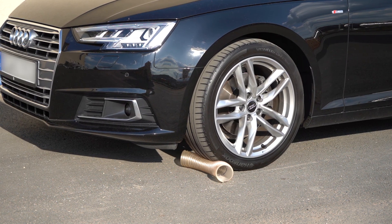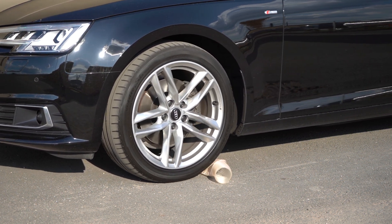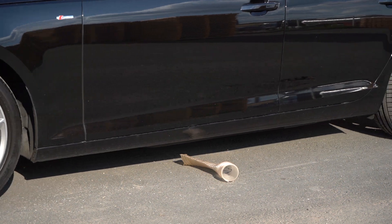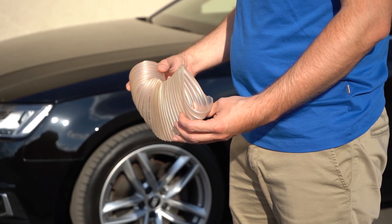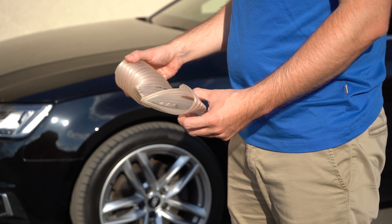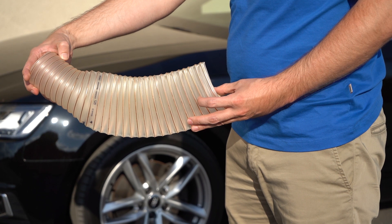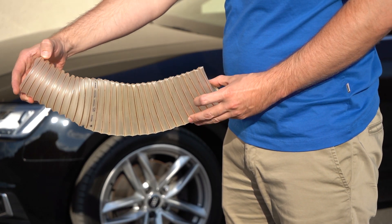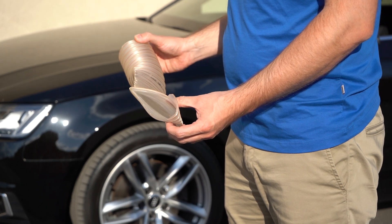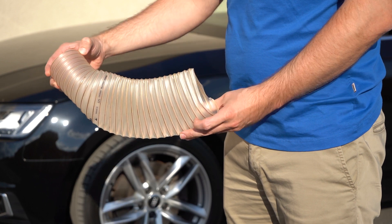As we can see, the metal spiral has at the beginning a good resistance to stress only. However, the hose is not designed to handle this kind of load. The result is the plastic deformation of the hose wall. Although the hose is not completely defective, it is weakened in the affected area. It therefore no longer has the original pressure stability and the original profile. The flow rate and the flow resistance would no longer correspond to the initial state.